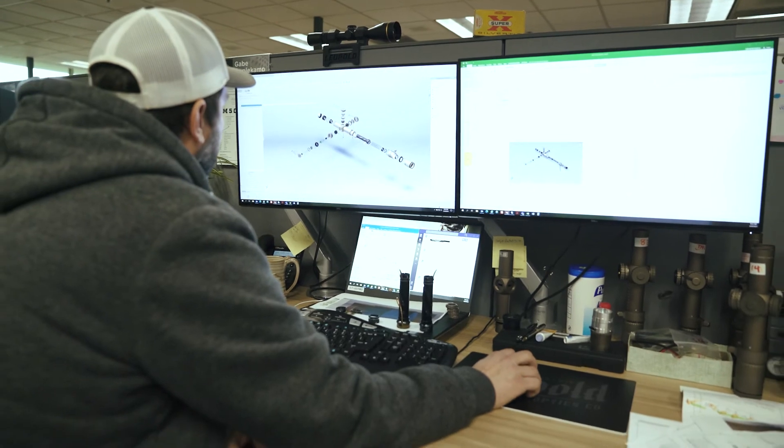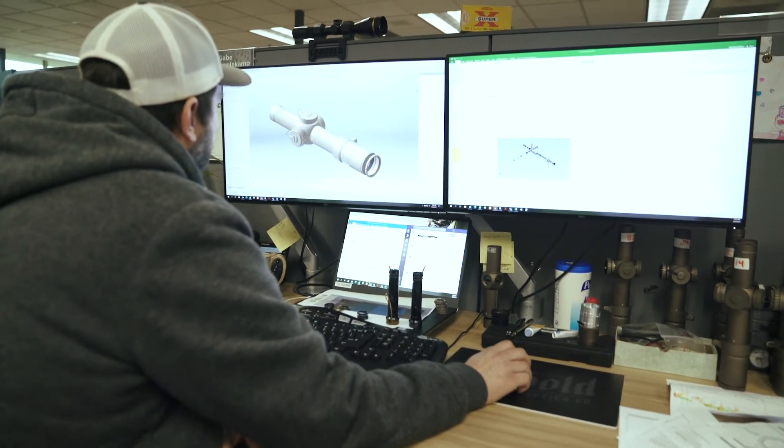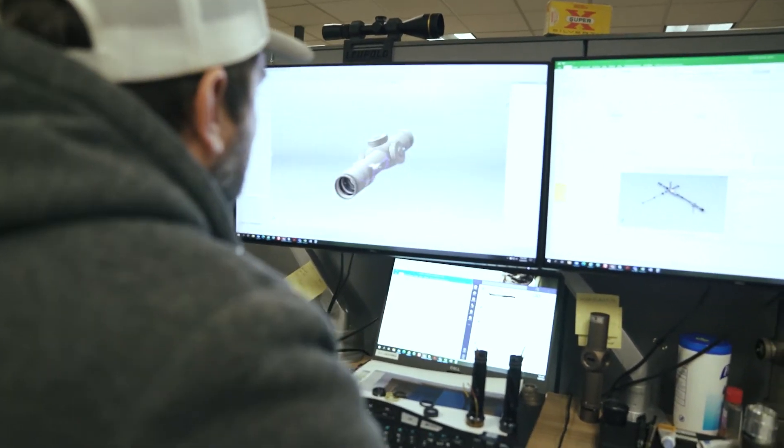We'll start there and create a kind of breadboard — think of an exploded view of a scope where you lay all the parts out so you can see them. We go from a computerized design and then physically look through it, because the software is only going to tell you so much. Then we run it through our optics lab: we build a little prototype just holding the lenses in place and look at things like stray light analysis, which becomes glare. Glare is a big problem in the field for shooters. We'll look at how much light is reaching your eye and from which wavelength — we test the entire visible spectrum even in this early stage.